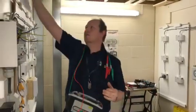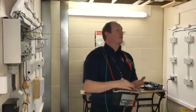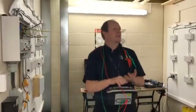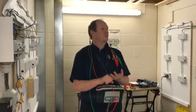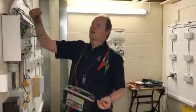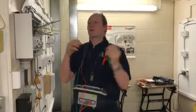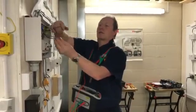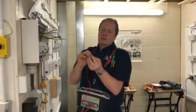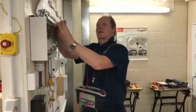We need to do two equations: R1 being our line conductor, and Rn being our neutral conductor. We add them together and divide by 4, and that will give us an anticipated result for step 2. For step 2, we're going to be joining line-out to neutral-in. We can use crocodile clips or WAGO blocks. We join that together, and then we do the opposite: neutral to the line conductor.